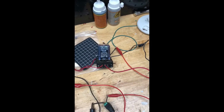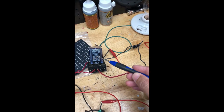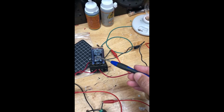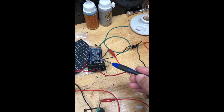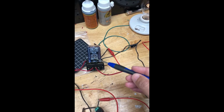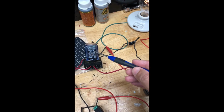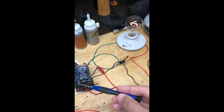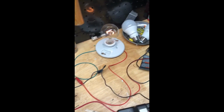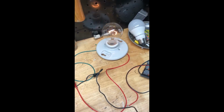So when I turn on power, the power is picking up from the wiper, jumping from the normally closed pin to the coil. And as soon as the coil receives power, the wiper is going to drop out from the normally closed to the normally open. So from number 8 to number 7. And this cycle continues here, and that creates a flicker light effect.